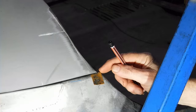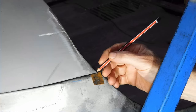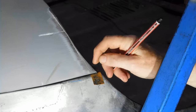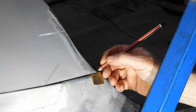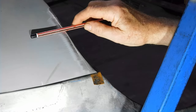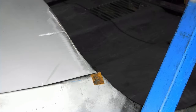Now I've identified how much metal I've got to put on here. It goes to the edge of the copper — that's where the wheel arch finishes. So I've got to fill this in here, and then it tapers as it goes up. I'm going to use the MIG welder to drop some welds in — I think that's the easiest way to add the amount of metal that needs to be added, and then I'll start shaping it. It goes from there up into here; it's a lot thinner up here of course, but it gradually gets thicker as it comes down to the edge. Everything's positioned and the bottom panel is actually bolted on, so it's in its final position.